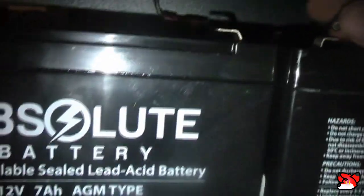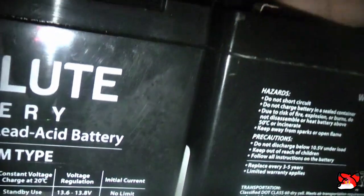But these are the kind of batteries that you want to use for fire panels. It's always a better idea to go to the 7 amp hours. Now I'll probably grab more 5 amp hours for the other panels. And the reason I'd be able to do that is because those panels are for demonstration uses only. And for this system I need something a little bit more powerful to hold a charge. But for those demonstration systems, if I do kill the power to them, it's only for maybe at the most 10 minutes. So I don't exactly need anything that powerful for those panels.